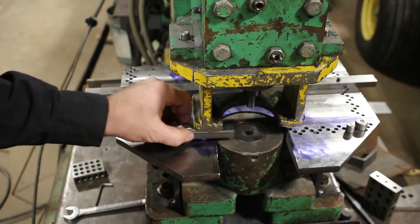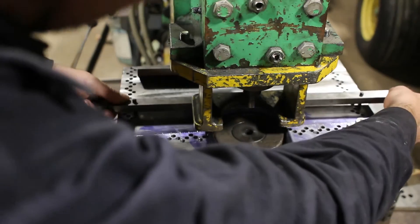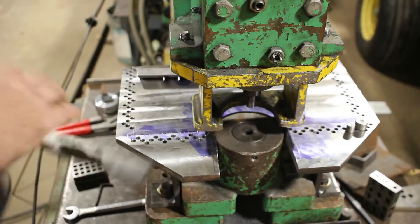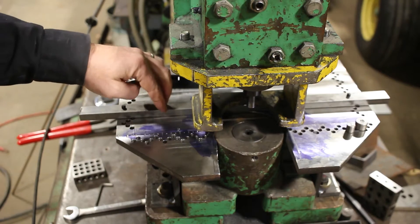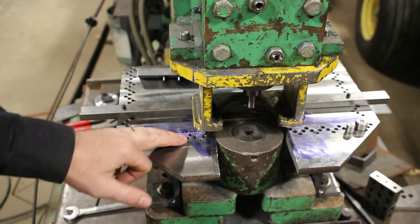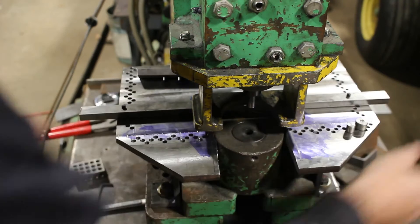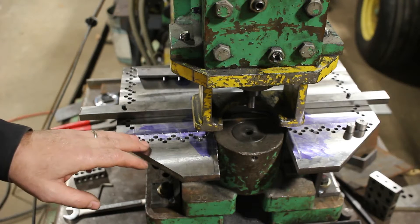If I want to go to one inch on center, I just drop it in the holes. I also have this big bar in the back that can zigzag along whatever set of holes it needs to go in, and this bar can also flip around and drop in the other way. It's labeled with a plus and a zero, so if I want to add an eighth of an inch I can. This setup will give me an eighth-of-an-inch resolution — it's not going to be super accurate because things slop around a little bit, but with punched holes and sheared ends it's going to be far more than close enough.